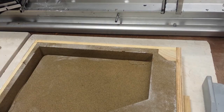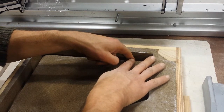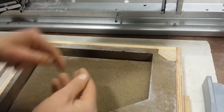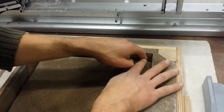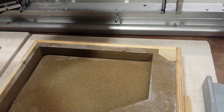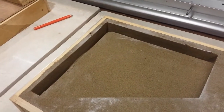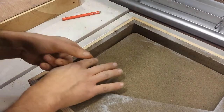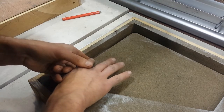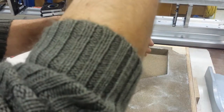So there are bits where it's broken, like here, so all I'm going to try and do is a very slight little bit of repair with the fingerwork. We're pushing here rather than dragging, just pushing it together a bit. There are some little bits down this side - made it a bit worse that time. This is a classic problem with green sand casting. I go into some details in the blog post that goes with this video about how to make better corners.